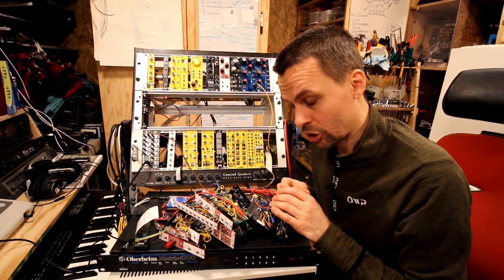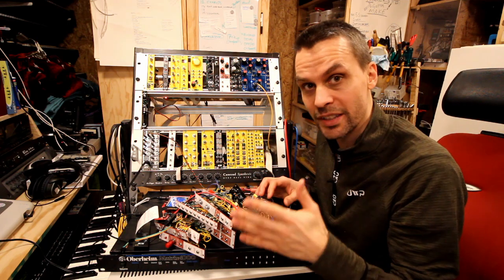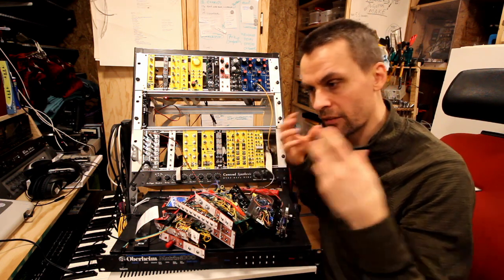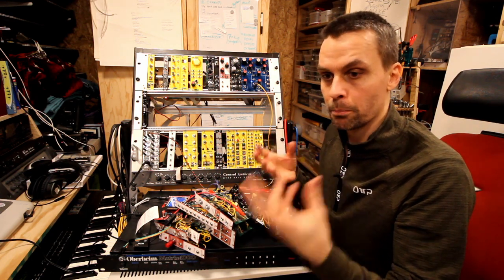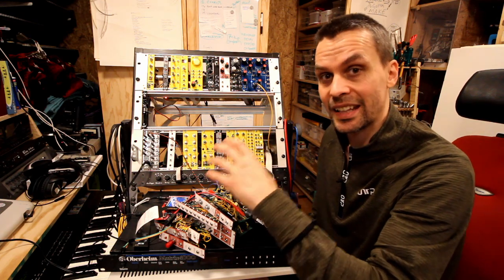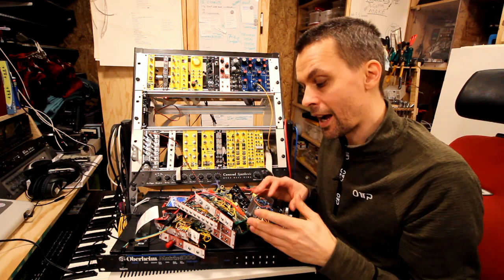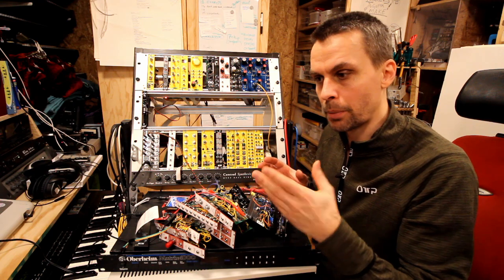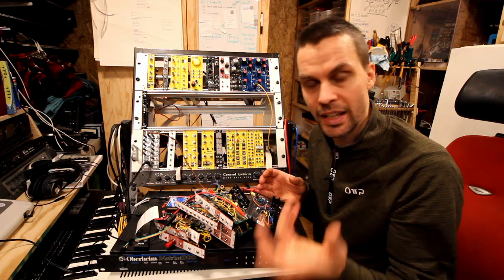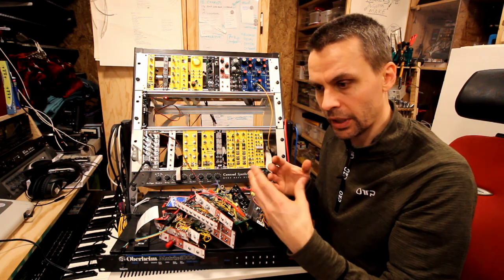It's not much. One thing is that I upped the capacitors to 4700 microfarad, which really helped a lot because the regulators have way more power to work with. But the really big ones, like the Frequency Central one, I think I have 10,000 microfarad to work with. I've also said you can use AC power from 12 volts and up, because I know that a 12 volt AC adapter probably gives out 15 or 16 volts.